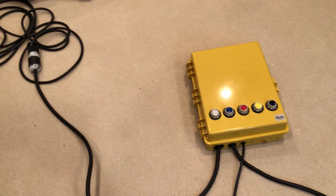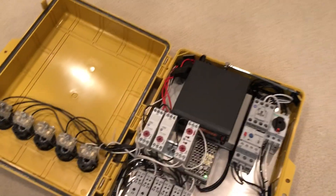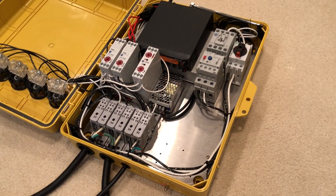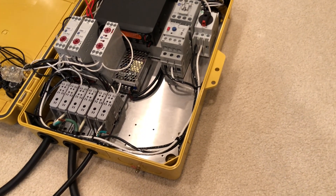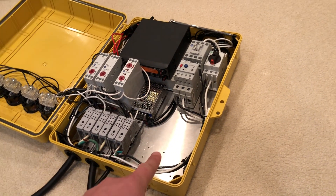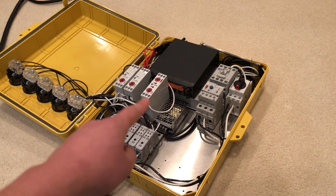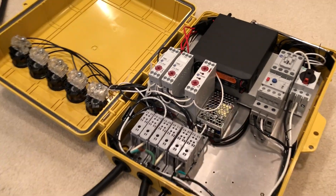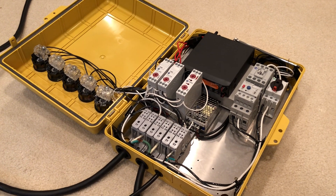Thank you for watching. If you guys have any further questions, don't hesitate to ask. Actually, I lied — that's not the end of the video. I remembered I was going to talk about the fire circuit. Just a quick overview: I left this space blank intentionally. It will be just big enough to house the original-style Signatrol flasher unit. I could go electronic with that, but this should fit one of those Signatrol units. The only other timing relay I would need is another off-delay to power the flasher unit, which is why there is a space left here.